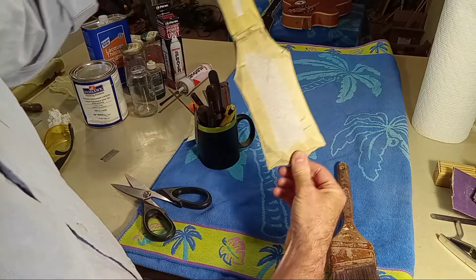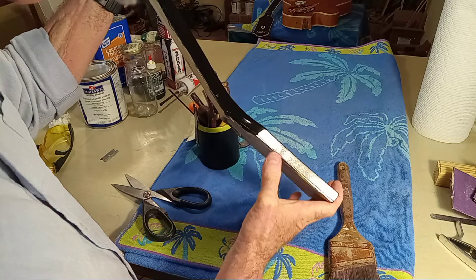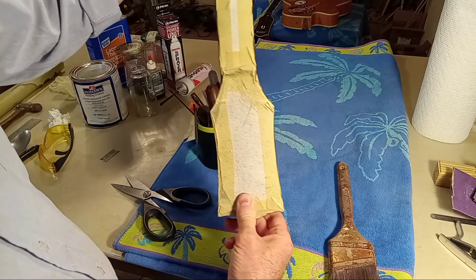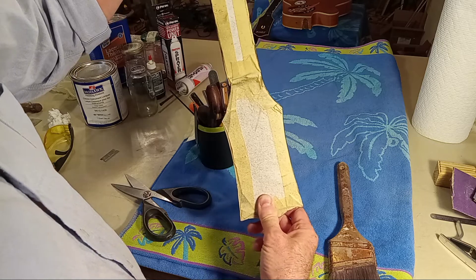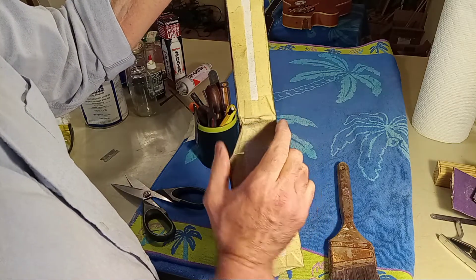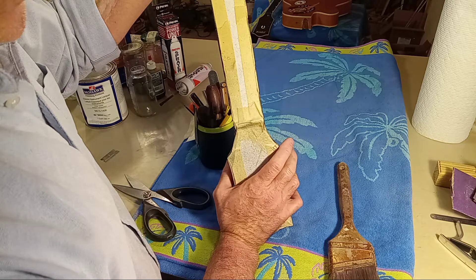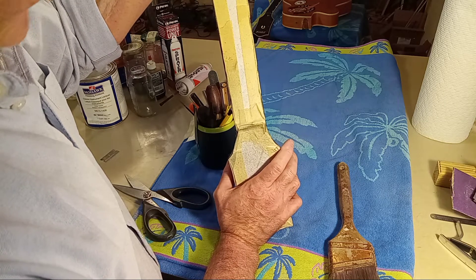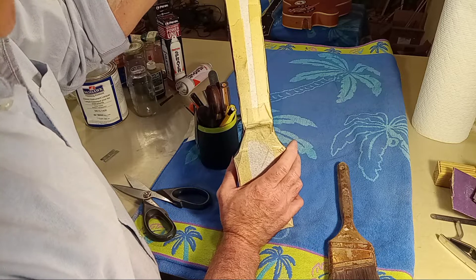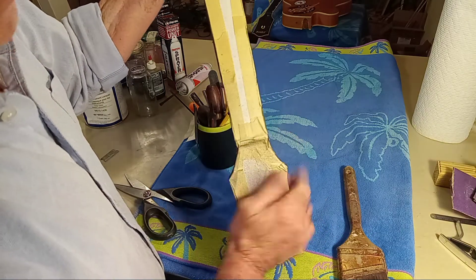You'll see how I did the same thing on the headstock — perimeter taping, letting the tape run high over the white binding, then cutting a rough headstock profile on a piece of 60-pound cardstock. I like working with thick paper. The bone nut is already installed under there — I epoxied it in. Most builders would frown on this — it'll be a nightmare if you ever have to remove it — but I wanted to really optimize tone with this guitar and felt confident about the bone nut.